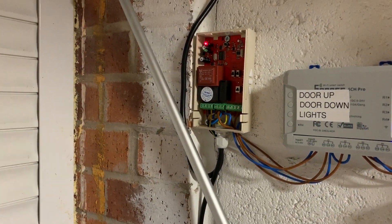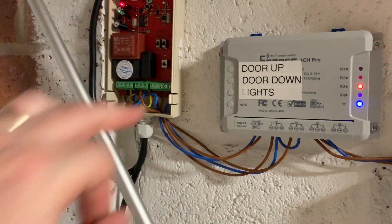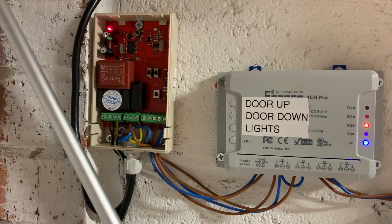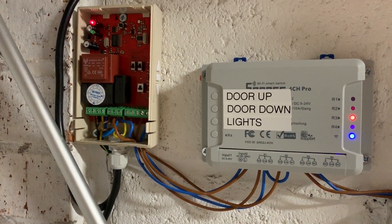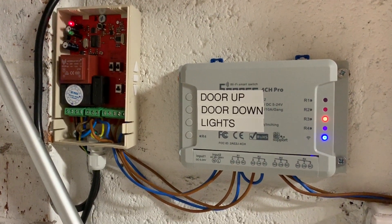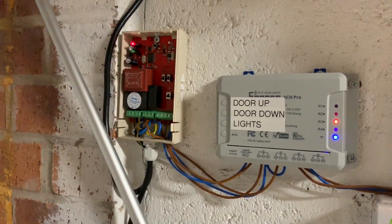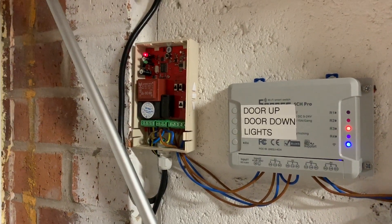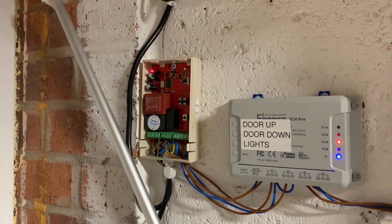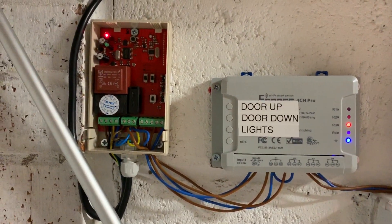So I knew I was halfway there. The next thing I thought of — after looking around on YouTube — was you could buy one of these boxes. It's called a Sonoff, or SonOff. There are various versions of it; this one I bought was about £28. It's the four-channel pro, and this version has got inching mode. Inching mode is essentially a momentary push button — you can set it to press for just a second, which is exactly what you need for these garage doors.